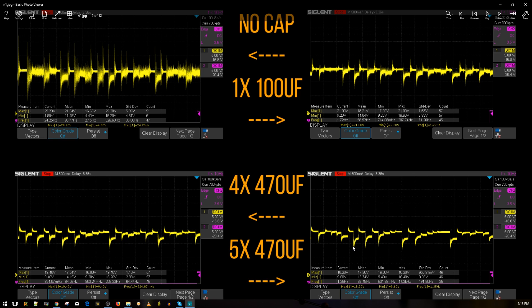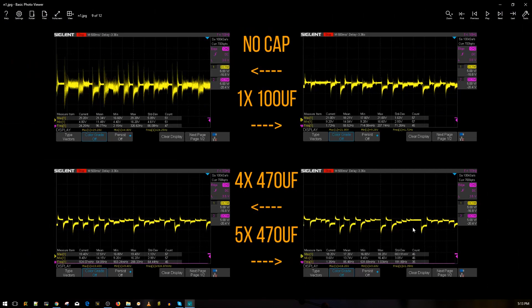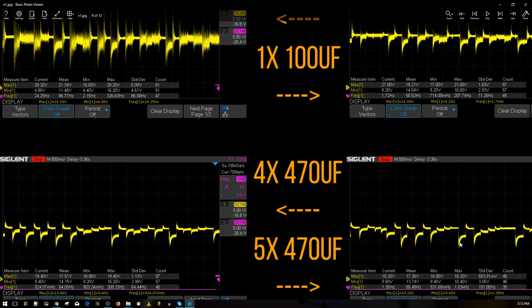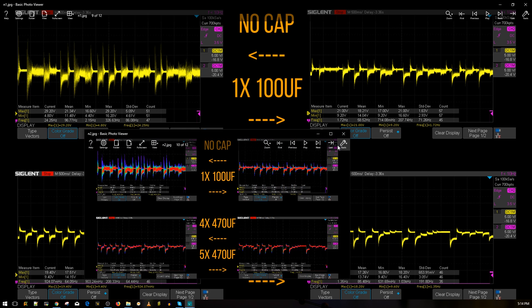With five capacitors, the yellow lines are closer together, meaning it's running cleaner. This is still technically considered noise, but it's not really noticeable noise when you look at it. The five caps does make a difference — it buffs out some of the voltage drops, keeping things overall pretty clean during rapid speed changes. These little arcs are a little bit fatter with four caps versus five — still noticeable but quite minor. It's not necessarily required to put five, but you can and you'll get slightly better results.